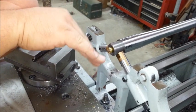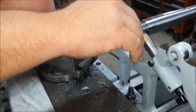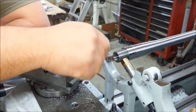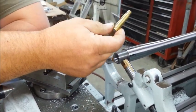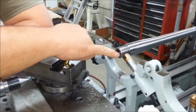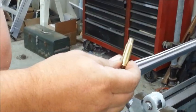You'll notice problems with guns using steel cased ammunition — there's so much bolt thrust that it starts to break things, because steel doesn't swell up and adhere to the chamber like brass does, just for a millisecond. That's why you can't feel it when you pull the brass out. But during the explosion, the piece of brass actually has more to do with holding everything together than the bolt does. So if you make the chamber absolutely smooth and shiny, you might as well be using steel casing — you're losing friction to hold it together under that very violent explosion.